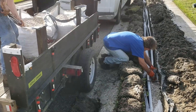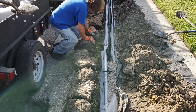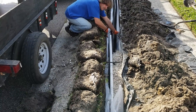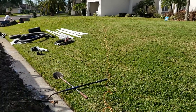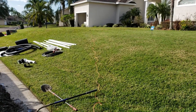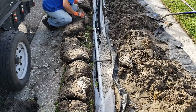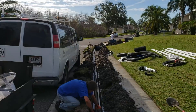So you can see what we're doing — we've got this gravel that we got in big bags. This is limestone, that's what's available best in Florida. If you're up north, you're probably going to get more of a granite or a quarried stone. Limestone works good. It's not washed, but it does have big voids in it and allows water to drain through it. They use that in drain fields — and you can see how that's a mound in the yard. The septic's up here, and if you understand how a drain field, some people up north say leech bed, but it's a drain field. That water drains down through the gravel, and that's where all your septic water goes. We're using it the other direction — the voids allow water to flood up into our pipe, and once it goes into the pipe it's carried away down to the sump basin where it's discharged back up.